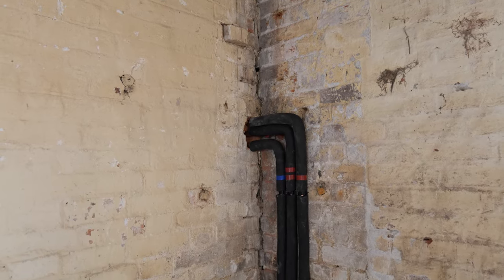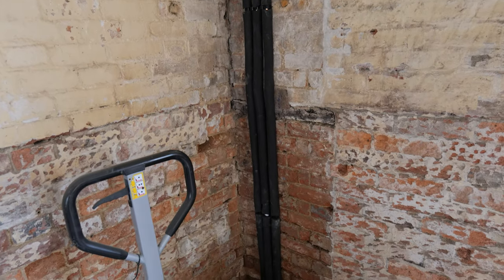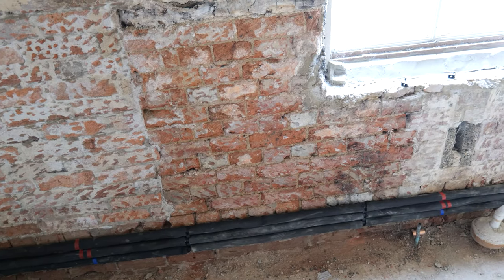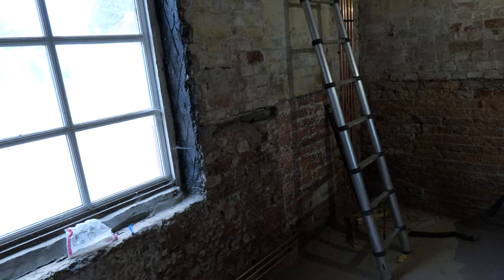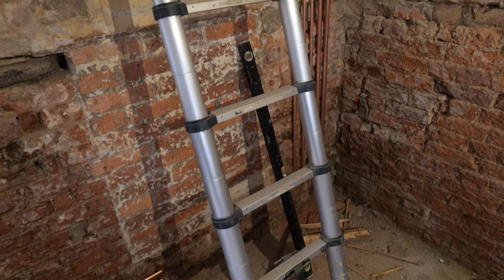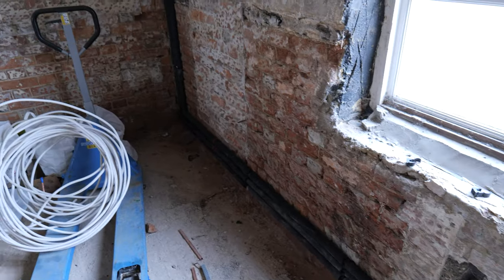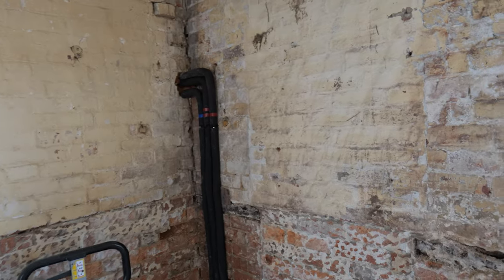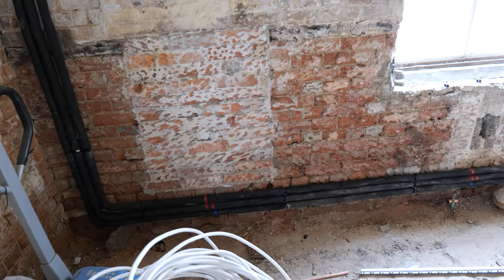While I've been working on the cloakroom and utility feeds, Bailey's been working on the feeds for the kitchen sink — hot, hot return, and cold main coming through here. He's dropped it all down in copper and insulated it, so it's all good to go. You might wonder why I didn't just nick those feeds for the cloakroom and utility room — the main reason is I want to make sure the kitchen sink is totally separate from the rest of the system so if there's ever a problem it can always just be left on. Also I don't want the cold mains drinking water being stored in a DAB tank — although it is potable, you're going to be drinking from it and I want it to be a direct supply.